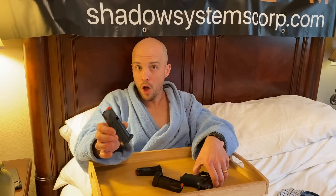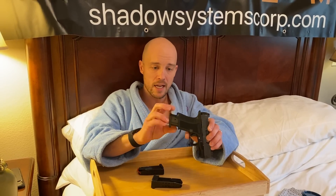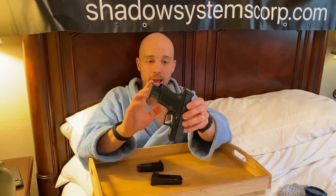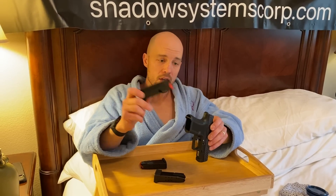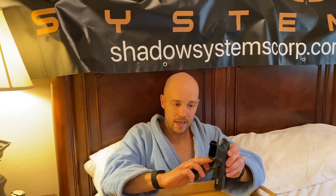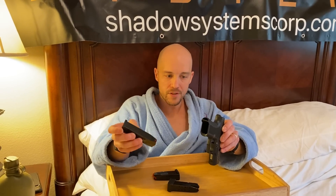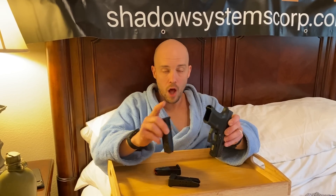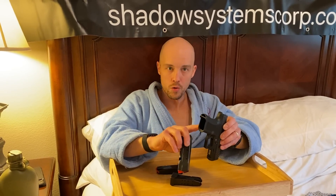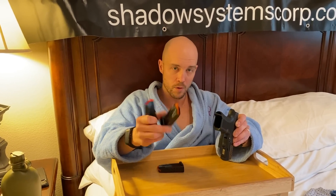The other thing is it's kind of longer than we needed. We were talking about keeping the gun relatively small, so our magazine is 13+1. If you were to put a Shield Arms magazine in the gun, it sticks out quite a bit. Now, it is actually possible to run one of these in a CR920 if you really want to, but you have to switch out the magazine button, because the magazine button we put in the gun is designed around our magazine tube and works with our 13 and our 10. If you really want to use the Shield Arms magazines, you can put in a Glock-style button and you would be able to use the magazine in this gun — it'll just be right-hand only. So it's not totally incompatible; it's just not compatible with our magazine button, which is designed to be reversible for our magazines.